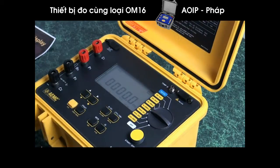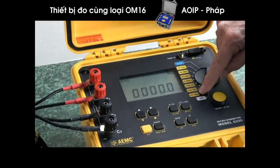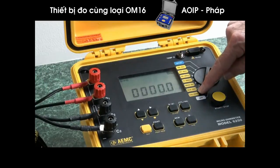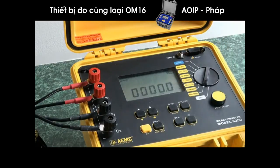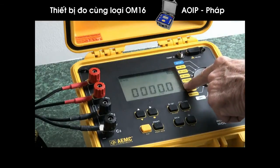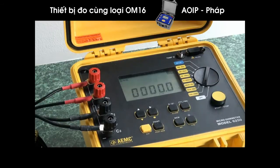The instrument is in standby, so when I hook up to a test specimen and activate the test, you'll see it operate and return to standby. We'll start on the low scale, which puts only 1 milliamp through the bonding connection and allows us to read up to 2,500 ohms. We know the resistance is going to be pretty low, so let's walk our way up. At this scale, we're reading on the ohm scale at one-tenth of an ohm range, which tells us we are further down the scale.